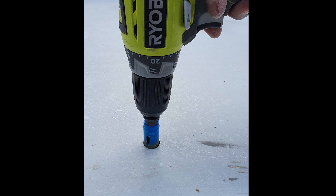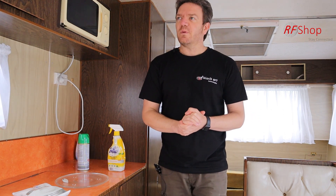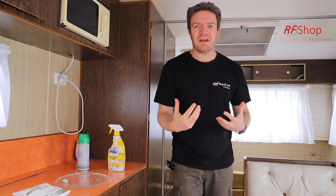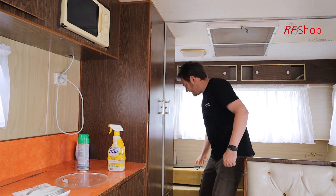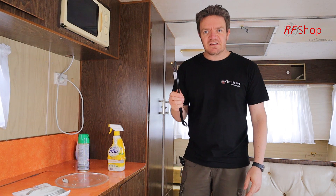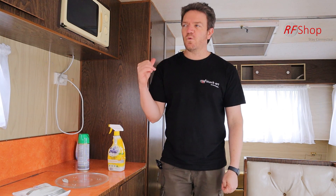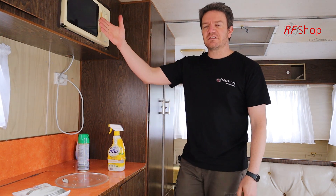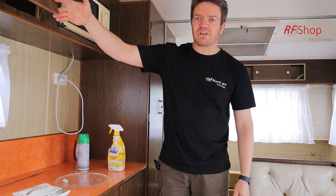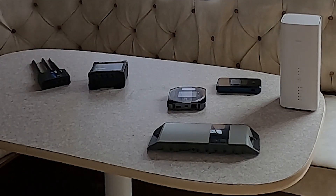The antenna on the outside is just on the other side of the roof. It's basically drilled a hole into the ceiling and coming through here, so you carry the antenna on top. The key thing is I want to keep easy access to all the modems and all the options, so I have the antenna wire — which is basically the Coax cable with two SMA connectors. It's quite long. As a user, you would install this professionally or yourself with nice routing in here and then maybe create yourself a little comms cabinet where your modem can sit nicely tucked away.